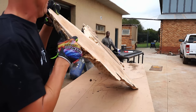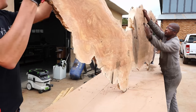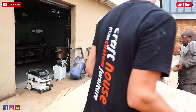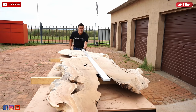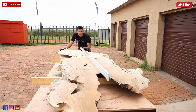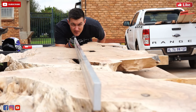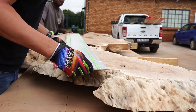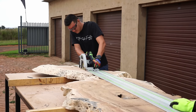There are a few ways to dry your wood. The first option — drying naturally — can take two to three years. The second option, which we currently use, is a kiln oven, which takes six to eight months. The third option is a vacuum kiln oven, which can take around two to three weeks depending on slab thickness, but they are super expensive. In South Africa we don't have a vacuum kiln oven.